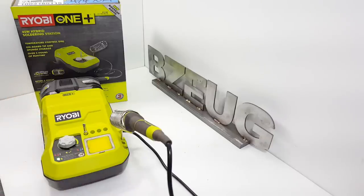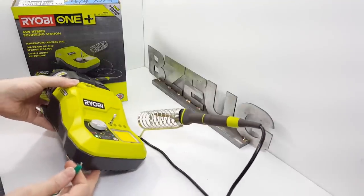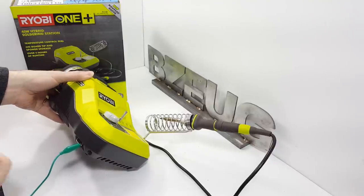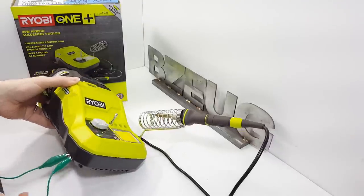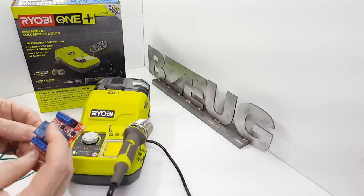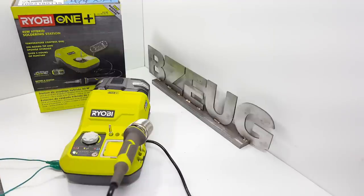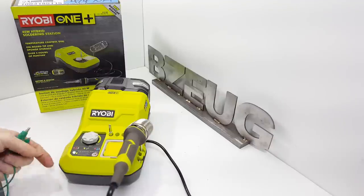This has a grounding loop here — you can see it. You put a ground strap there, and you can put another ground strap for a wrist strap so that you can ground yourself. If you're soldering something really sensitive, this keeps you completely grounded so you're not going to get electrostatic discharge while soldering. That metal loop right there is a grounding loop.